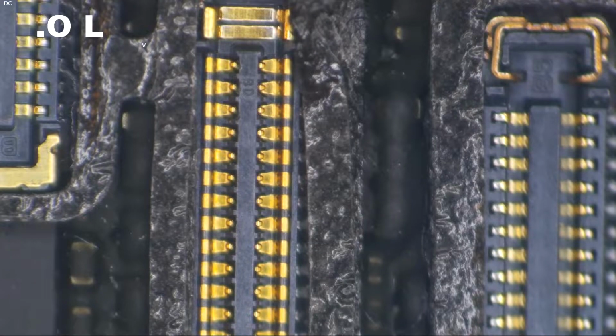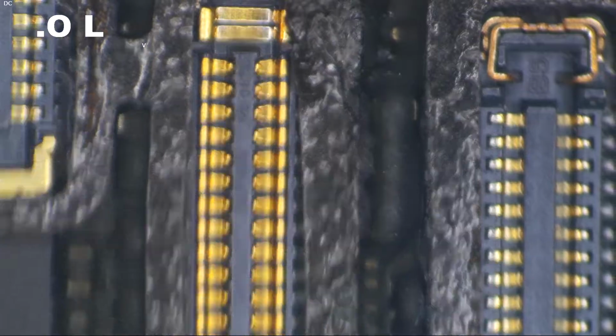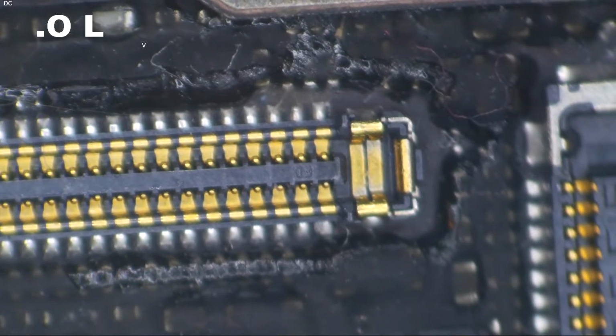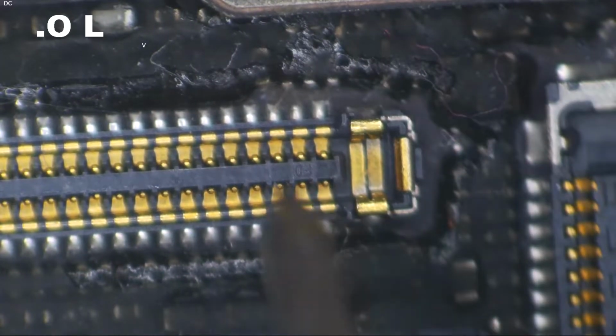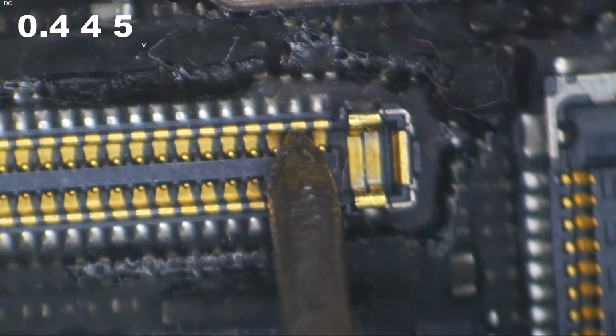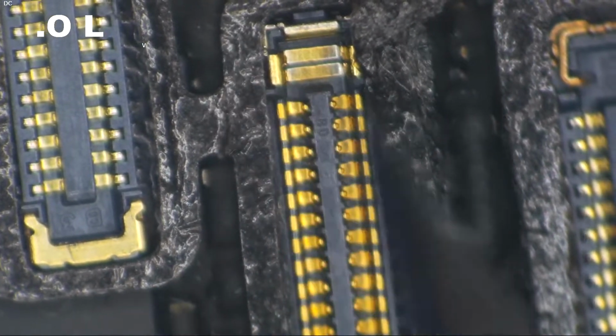If we don't know what the normal diode mode reading is supposed to be, what we can do is check on a known good board. This is a semi-known good iPhone 6S. You can thank the customer who never paid their return shipping bill for this measurement. We are going to put our red probe on ground, and our black probe on backlight anode. And we're getting a 0.44. We're getting the exact same reading. So we know that we're getting a good reading on the backlight anode,